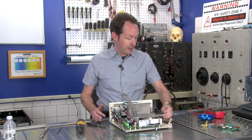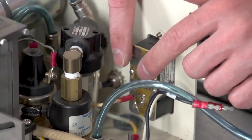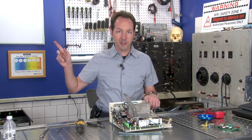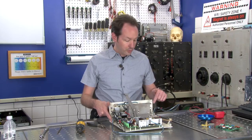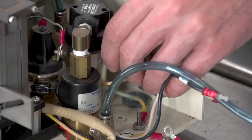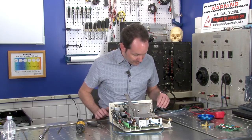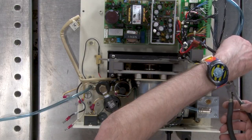So if you have this box with line and neutral coming in, the line is at 110 volts and the neutral is at zero — but zero relative to the generator at the power company. You need a way to make the frame safe, so you connect the frame to your neutral or ground. This is a three-pin so you've actually got a ground as well. Get everybody on the same page with a zero voltage reference so the chassis is safe.